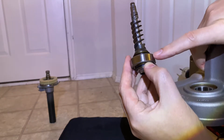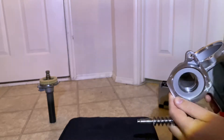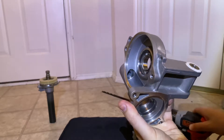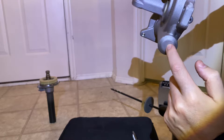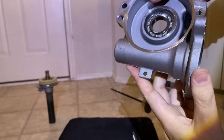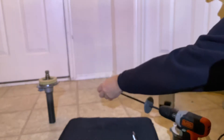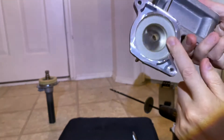Now you can see a little bit closer what's going on here. This is a nice little shaft that I'm going to take out. It's got a bearing here and another bearing farther down. So what I'm going to do is drill — instead of just drilling directly here, which seems very easy, but for a perfectionist, even though it's got a line through here, you can't really trust that to be a perfect center line. I figured the other way to do it would be to drill from the inside, and that's what we've got here.